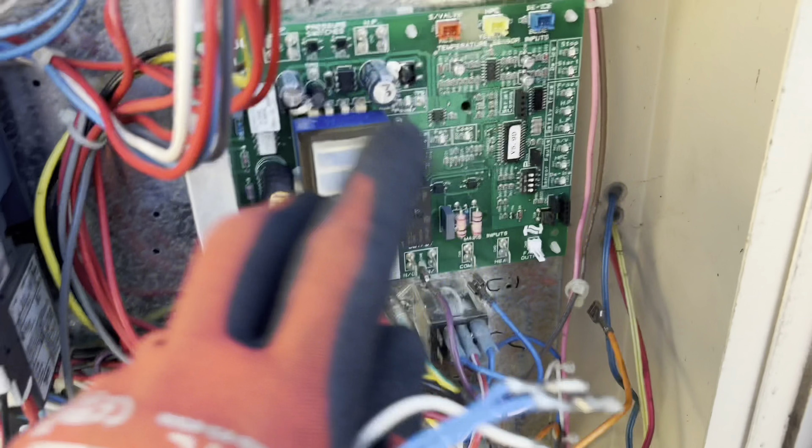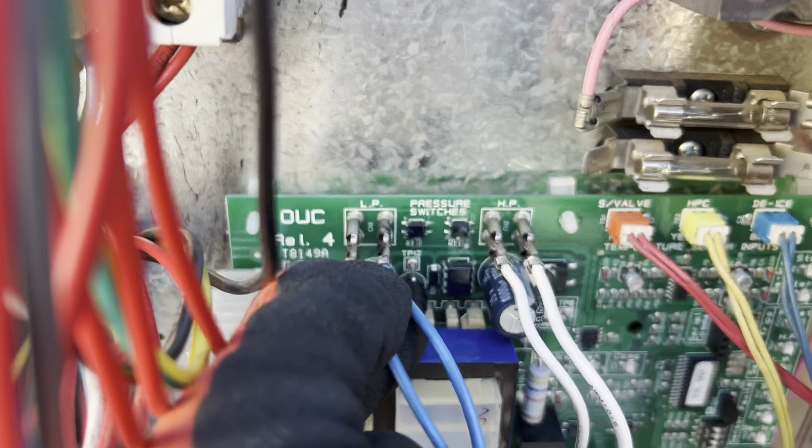I'm going to go through, tighten these up and get them back on. New board in. I've gone through and tightened all those up — it's a bit tight in here. Positioned it so the insulated one is right next to that, which is the way it was supposed to be. Just making sure they're not touching. Going through and tightening up the electrical connections, then we will reapply power. There was nothing crazy loose — still got a couple of quarter turns out of some of the ones on the load side. I'm confident we've done enough checks to get this ready to turn on.